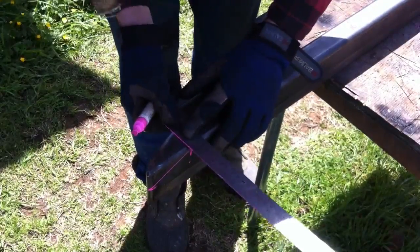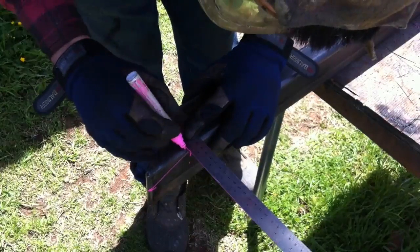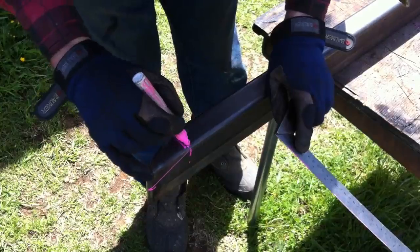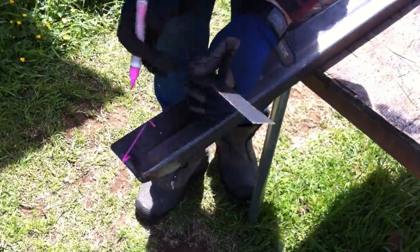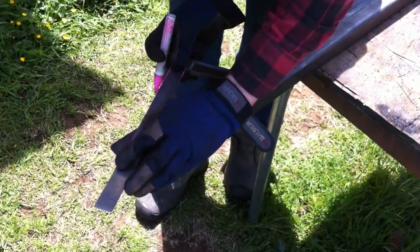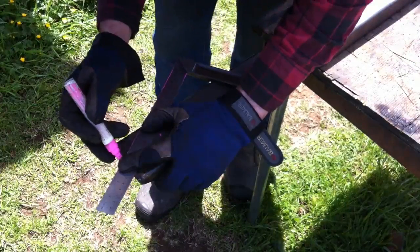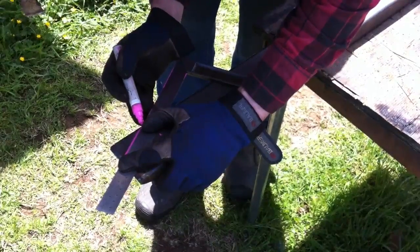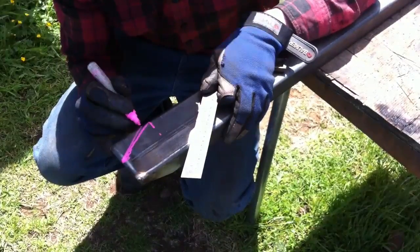And you know what, now that I think about it, see, I didn't pre-think it. What I should do is probably just make a mark right here for this other piece that I cut. So don't forget, when you make a new line that you want to cut, mark out the other one. Make sure you make it where you realize that line is no longer valid. So like here, I'll just go through that one. I know that's not the line I'm thinking to cut. I'll use the same point, however, and then I'll go from that point here, drawing by eye the best I can around this long radius.